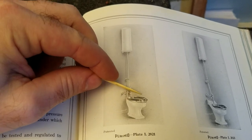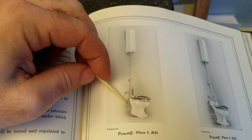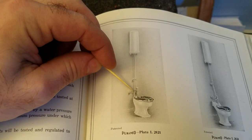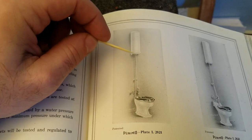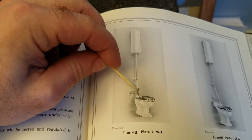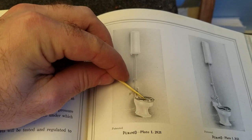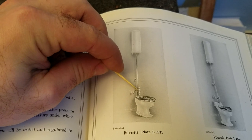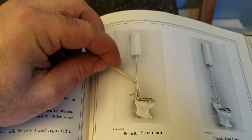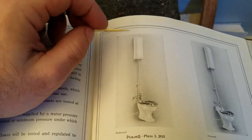This was also a seat-operated toilet. As shown in the picture with the seat sprung up, the water supply is turned off, the flush tank is empty, and the flush valve is left in the flush position. When you sat on that seat — or otherwise held it down — it would turn the flush valve off and turn the supply valve on to begin filling the tank.